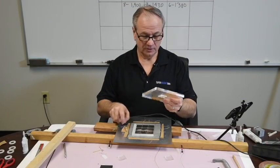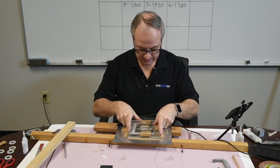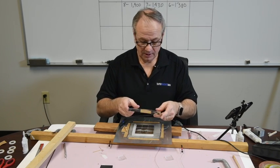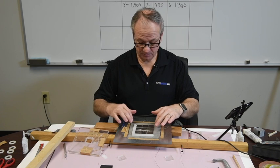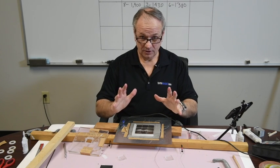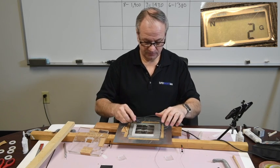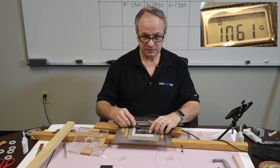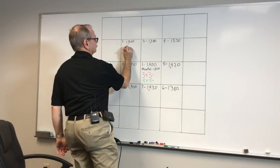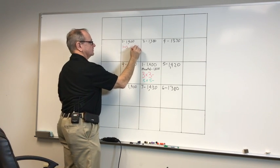I've taken the protective cover off. This cover let me push magnets through the slot and line them up one by one, forcing them into position. They're held with VHB tape on the bottom, with super glue and epoxy in between all the cracks — hopefully that holds long enough to get readings. The upper right-hand corner reads 1060 Gauss, so we dropped from 1400 to 1060 going from a single magnet to the 3x3.